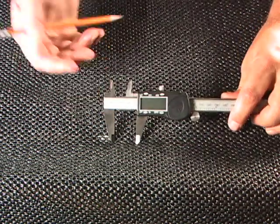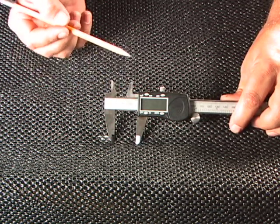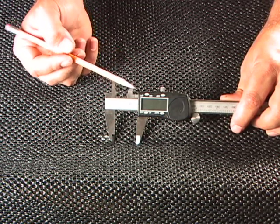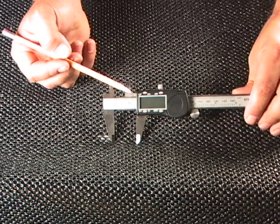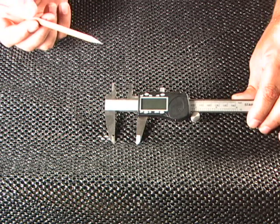So let me introduce you to our 6-inch woodworker's caliper. What we've done is incorporate a digital readout with nice large numbers, which makes it very easy to read. It reads in fractions, thousandths, and millimeter sizes. Now, unlike a standard caliper that really only gives you two dimensions, our woodworker's caliper actually gives you four.